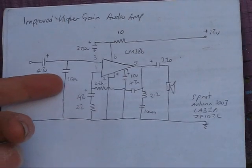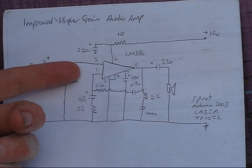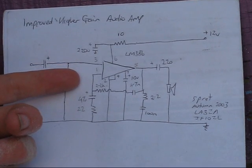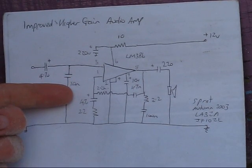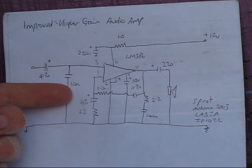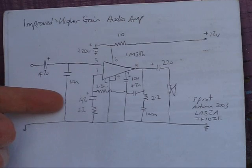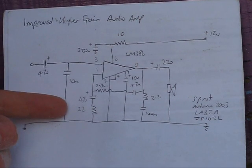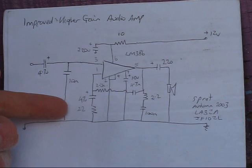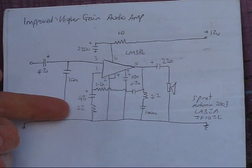Having a look at the circuit, there's no capacitor between pins 1 and 8 — in fact, pin 8 isn't used at all. Instead, pin 1 is used. There's a 47 microfarad electrolytic between pin 1 and a 22 ohm resistor, which goes to ground. If you decrease the value of the resistor, you increase the audio gain further, but you may get instability. So leave it at 22 ohm unless you want to experiment.